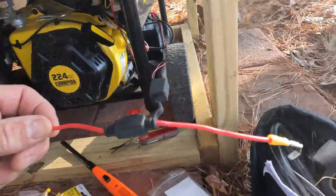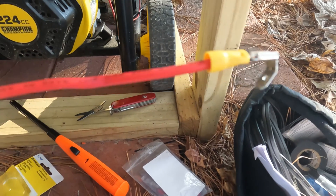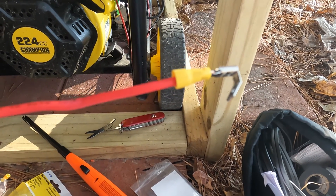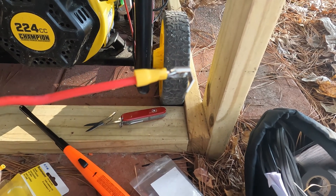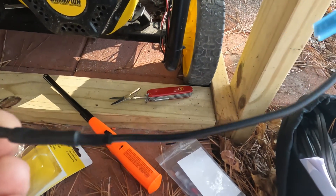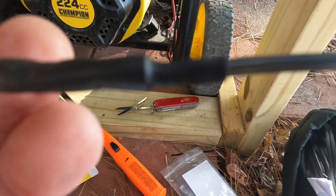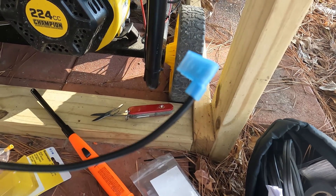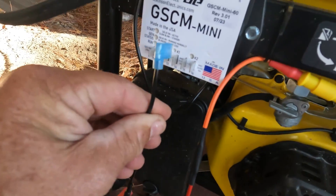Let me show you a typical wire you have to make up when wiring this up. This particular wire calls for a 10-amp fuse, so I used a waterproof 10-amp fuse section with a double connector, because I need to connect into an existing connector — the old connector goes right on as well so you can double up connections. Then I put a pigtail black wire, shrink-wrapped the connection because it's outside, and added a weather-resistant connection on the end which goes onto the proper terminal.